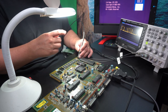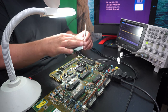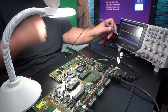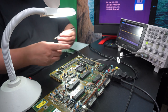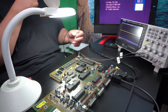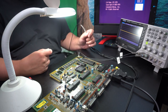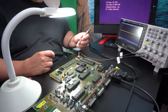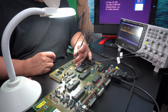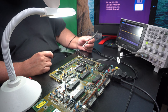And plus, there's a latch and a buffer working, so you have to understand that based on the enable signals, part of that gibberish is not even being used because it's transitioning between writing to the RAM and reading from the RAM. If you really wanted to clean up that display in terms of pure detail, then you need a logic analyzer. But hey, heck, wow. We have a somewhat working Amiga 500 Plus.